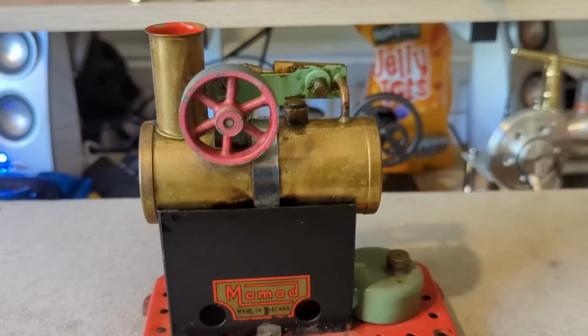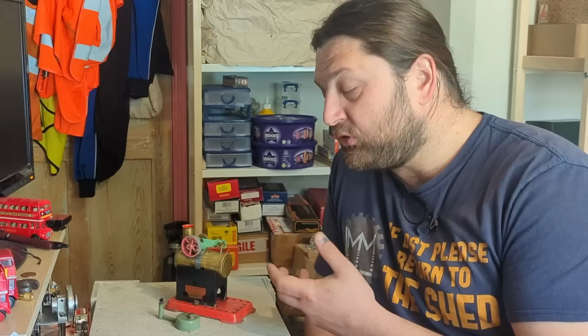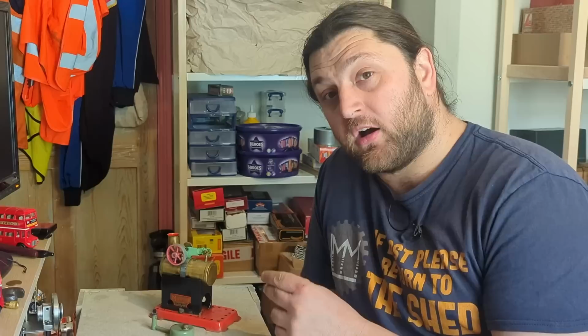One of these, however, when you've run out of water and you boil it dry, there is no more water. There's no more water to turn into steam and thus there is no more pressure. Yes, you could potentially damage the boiler from heating it and weakening it, but from a burner like this, a single wick burning methylated spirits or meths, it's unlikely that fire will be hot enough to do any real damage. So one of these, it's not such a bad thing. It's kind of ideal to avoid, but it's not catastrophic.